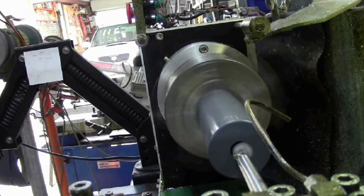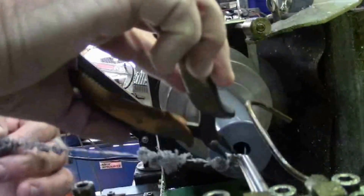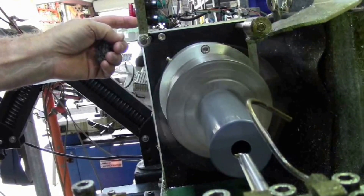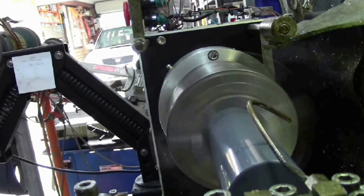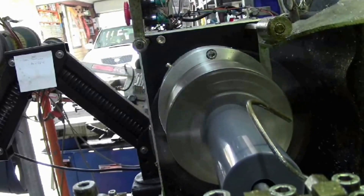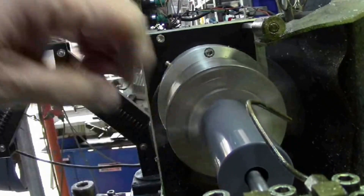Just looked up the end of the spindle — I can see the swarf there. It's actually come out with the compressed air. There we go, ready to go. Cycle start again after the M0 command. So I repeat this — this cut is at 15 millimetres and it's got to go out to 30 millimetres at the end here.